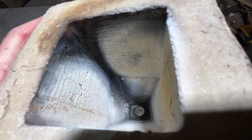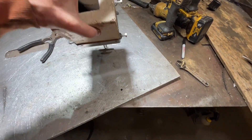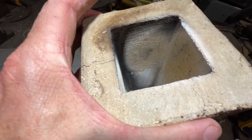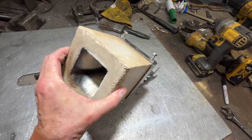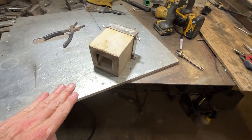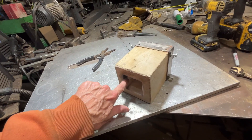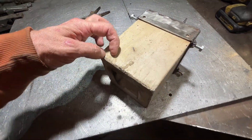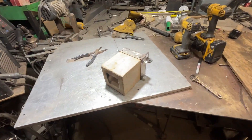In a furnace environment the recirculation gases will be on the order of 2,500 degrees. Some of that stuff fell off the wall there. I'm not too worried about this little bit of asymmetry because this thing is sucking air in on the peripheral edges, and we could clearly see that by some fuel that was being eddy-currented on the walls.